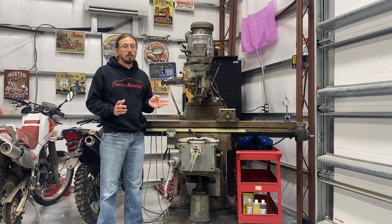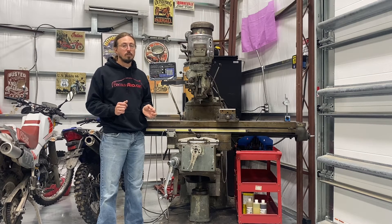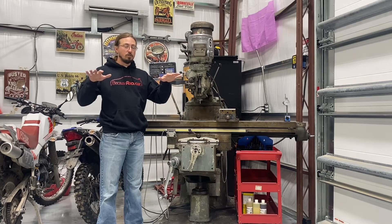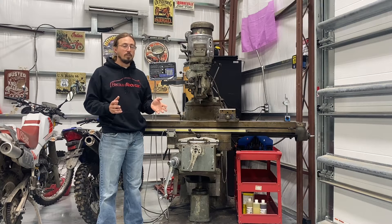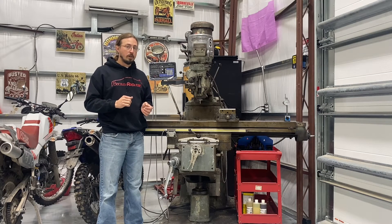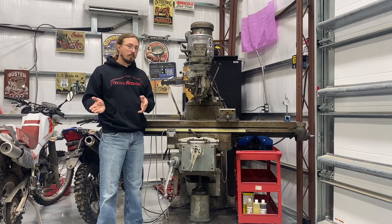So how did I move it? I'm going to show you some time-lapse videos — I didn't do a great job of getting live real-time footage while moving it. It was very windy and audio would have been terrible. The real key is having a hydraulic drop deck trailer. With a forklift you can easily load one of these onto a larger trailer, but unless you have a forklift at both locations — which I don't, and the shop I bought it from didn't either — that wasn't a good option. With the hydraulic drop deck trailer, the deck goes all the way down to the floor, so you can literally winch the mill onto the trailer and back off.